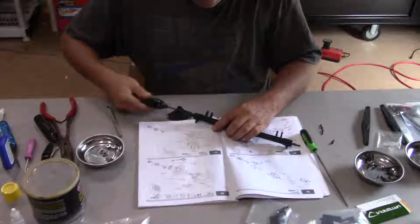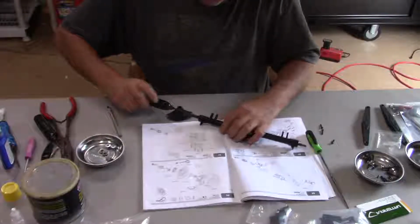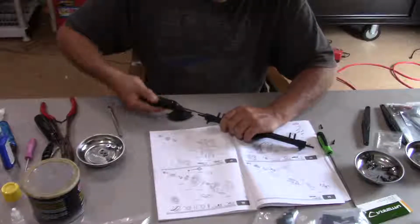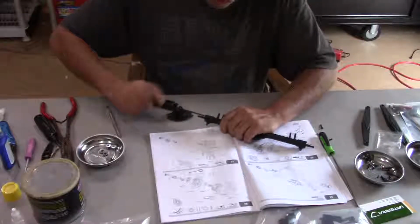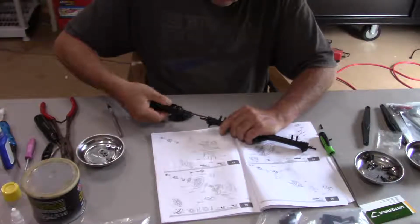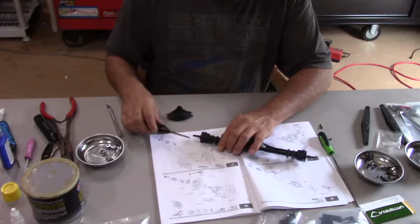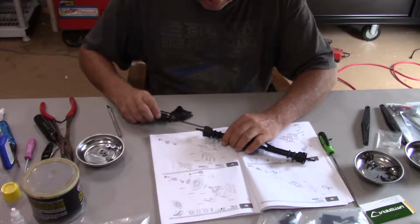Now, like I mentioned while I was filming in step A about these screws and plastic, I said not to over tighten them, because it's only plastic. I don't really use a drill driver very much anymore. I did at first. I watched everybody do it like everybody else did, and saw how quick everything was. But I found that even at the lowest torque setting, it was too much. So it's better to use just a driver like this and run it in by feel. When you feel the resistance getting great enough where it feels like it's tight, then stop.